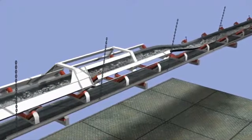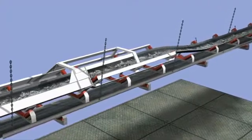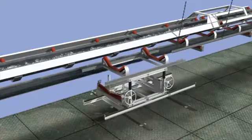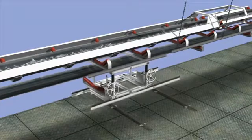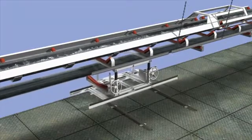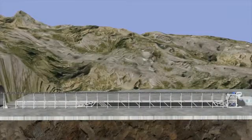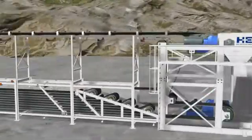The front section of the tunnel belt is also permanently mounted on the backup. The rear part is statically mounted on the tunnel wall and is continuously extended during the ring building phases to match the growing conveyor distance. In order to compensate for the increase in the conveying distance, a special belt storage system is installed at the launch shaft, which releases the extension of the tunnel belt as required.